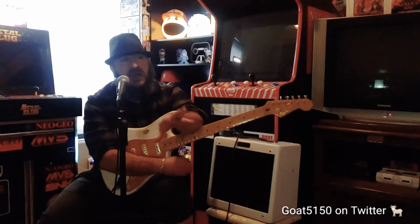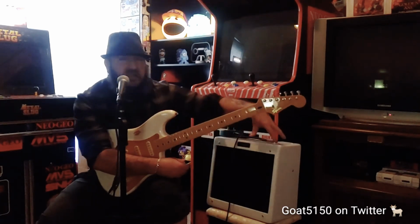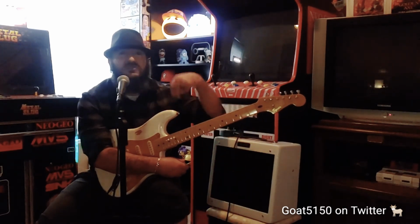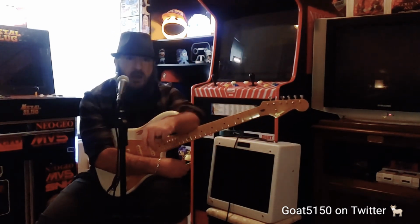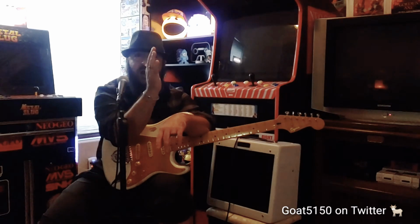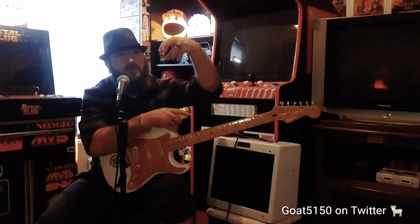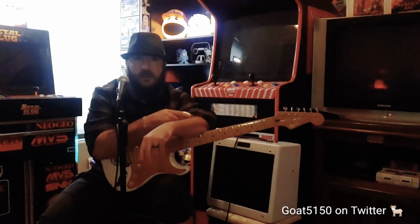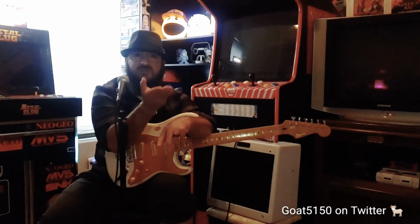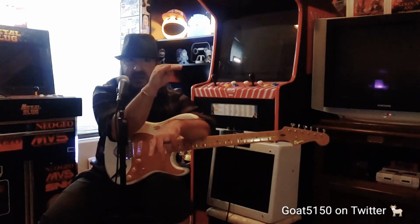And the only downfall to that, and this is not a big problem, okay, but there have been people that have experienced this. These things vibrate. Amplifiers vibrate. And it physically moves air. So over time, from playing the amp, especially the amp really pushed, the vacuum tubes vibrate. And what is happening is it's causing the solder points of the tube socket to break. And next thing you know, you don't have power anymore. You'll notice that your tubes look dead. It's because it's not making the connection to the socket. The socket kind of breaks free from the board.